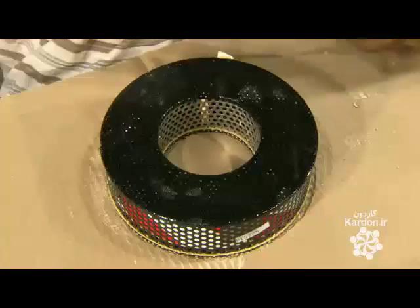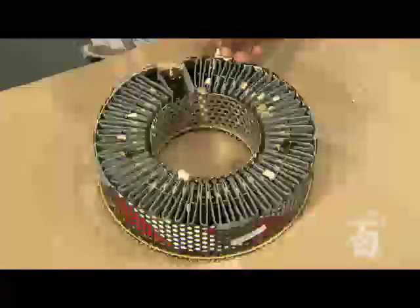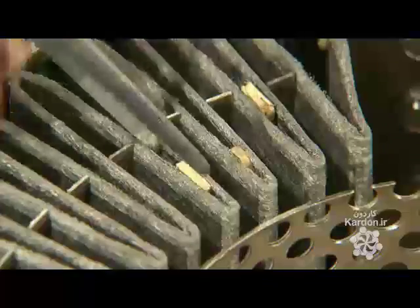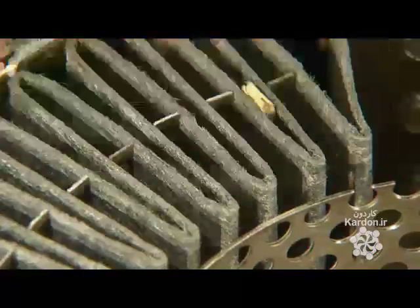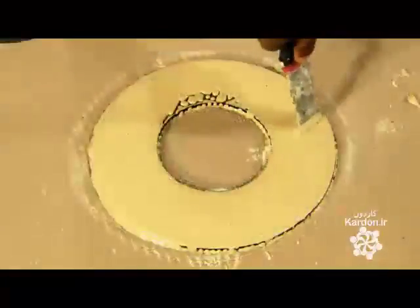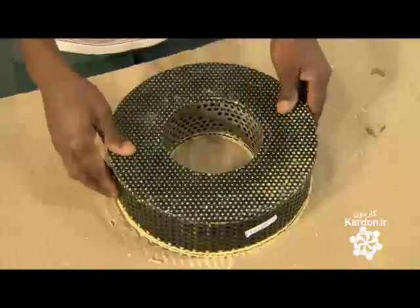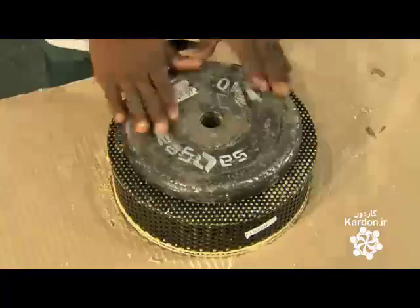45 minutes later, they take it out of the oven and remove the top plate. They also remove the spacing sticks and cardboard spacer, which are no longer required because the spacing is now permanently set in cement. They repeat the cementing process with the top plate. After a final 4 hours in the curing oven, the electrically heated filter element, this diesel filter's key component, is completed, and the main assembly can begin.